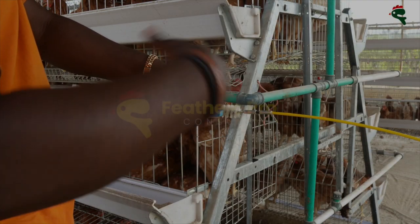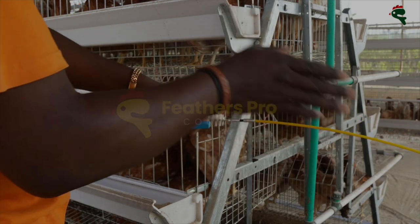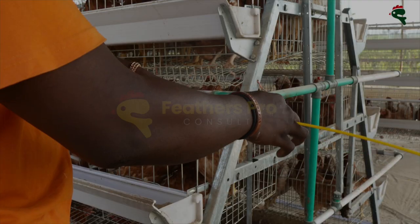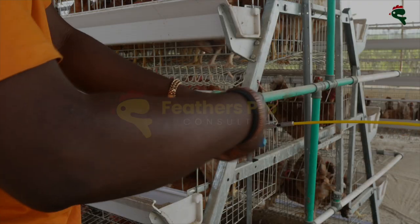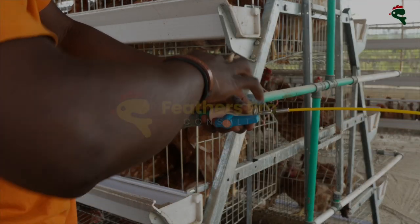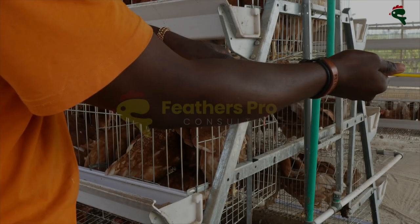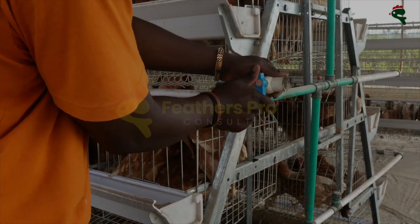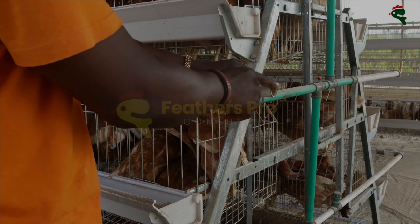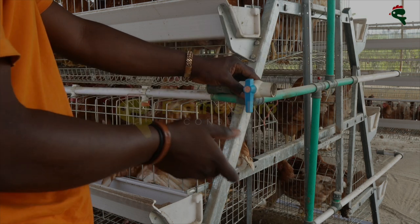In some cases you can pass it through the pipe twice. After that, you flush the pipe and the remaining particles get out easily. This brush is tight inside, so it touches the wall of the pipe and scrubs it, removing that biofilm. Once you pull it out completely, everything is clean. Then lock the valve back, run the water through, open the other end, and let the water flush whatever is left out.